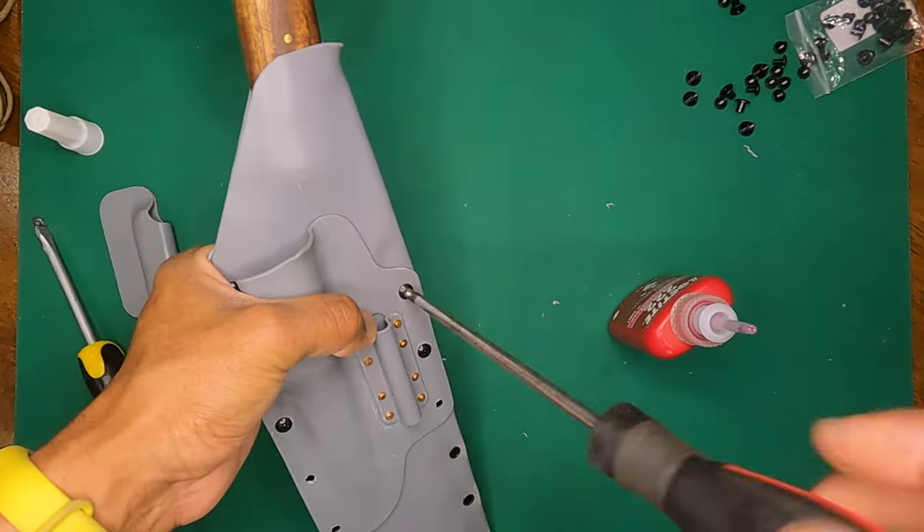That point helps you find a spot, put it exactly on the dot you marked, and when you start drilling there's a better chance of not running off. My brad point is quite worn but you can get at it. I'll drill at 5mm first then switch up to the 5.5mm bit and get the proper hole size through.